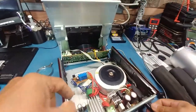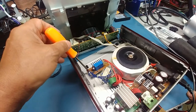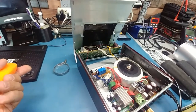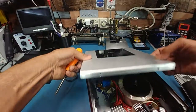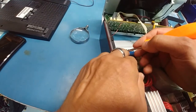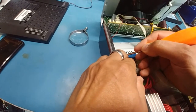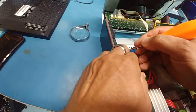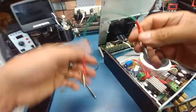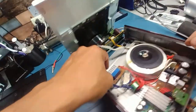I really want to power it up without replacing those caps - I don't want to damage the amp, but I'm just going to quickly try to see if my theory is correct. The power is turning on. Let's see if we can get the tubes to light up - maybe I can just short the pins together. I can definitely see it's a transformer because I can see the lights flickering. Okay, that's not going to work - let me put an alligator clip on it and be done with it. Okay, we are powered up.